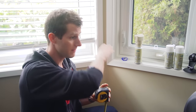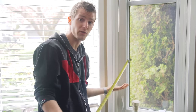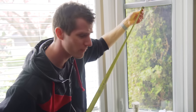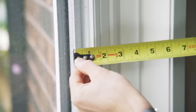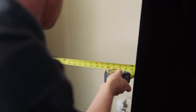The next thing we need is the distance along the wall. We have an easy landmark because we can see the brick on the outside of the house, which is what we'll measure from when we're out there. Eyeballing it, we line up the edge of our measuring tape with that brick and determine we need to go across about 28 inches. So: 19 and a half inches down from the window, 28 inches over from the edge of the wall, and we should hit that spot.